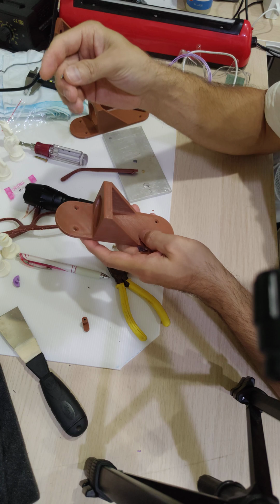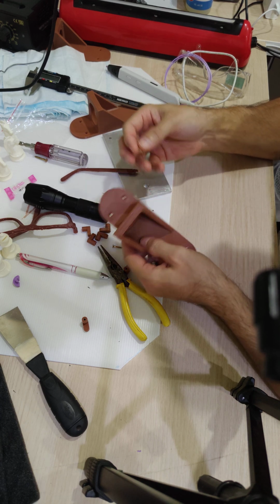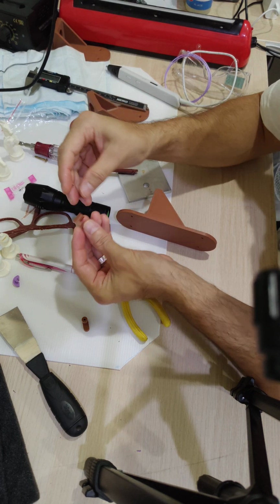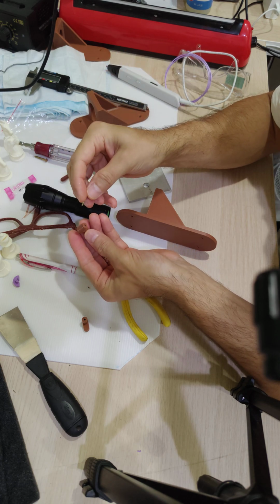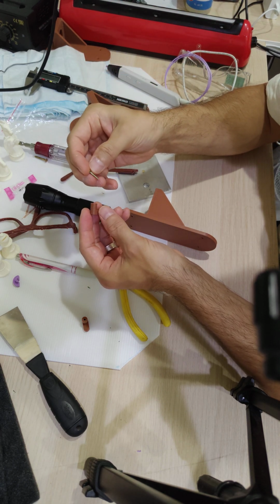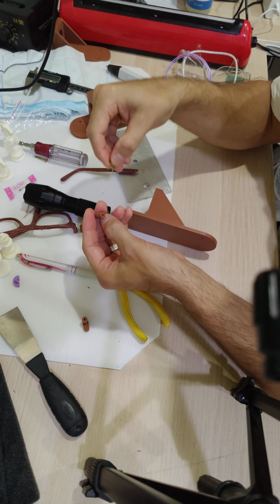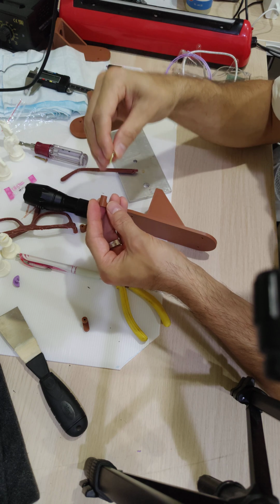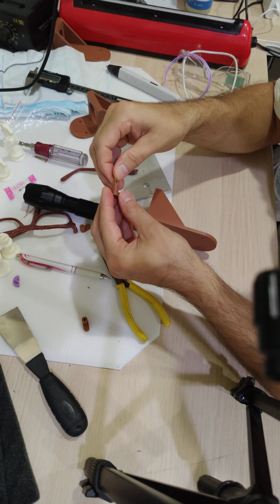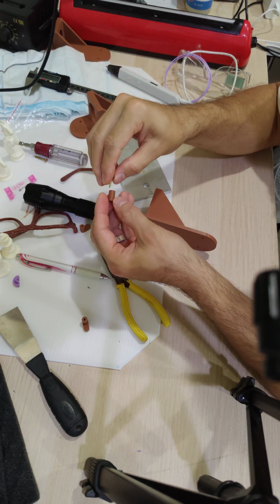It's nice and flush. Now, for the simplicity of printing, I didn't want to have any support material getting printed, so what I decided to do was make these little cleats that these screw into. The size that I have it set at right now seems to be pretty good, because I don't want to bite too much into the plastic, but I also don't want to do too much work to put this together. I want to be able to just screw it in. I don't want to have to heat up the screw so the plastic melts or deforms, preventing it from breaking. If you try to screw directly into a printed plastic piece, you could easily fracture it.